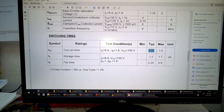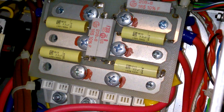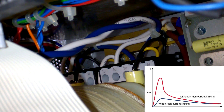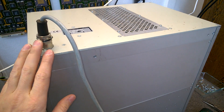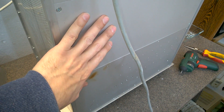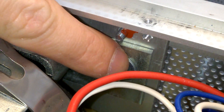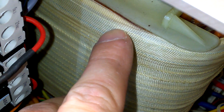This one is very fast. Down in there we have some large semiconductors - I don't know exactly which type. We have an inrush current limiter: a 2.2 ohm resistor in series with the power transformer, and after a few seconds it gets bypassed. Last but not least, I want to show you the mechanical structure of this unit - quite impressive. There's a nice aluminum structure, very thick plates of aluminum.